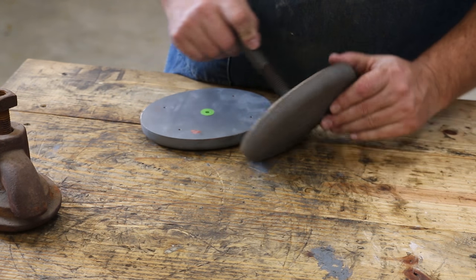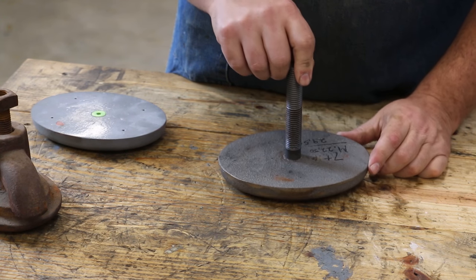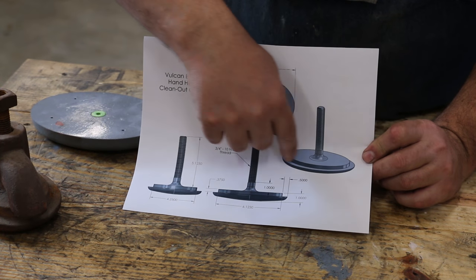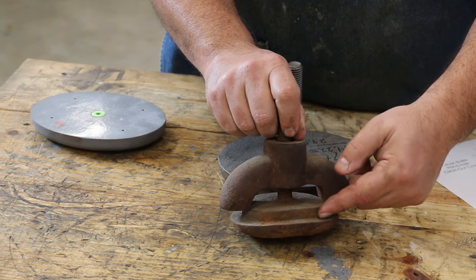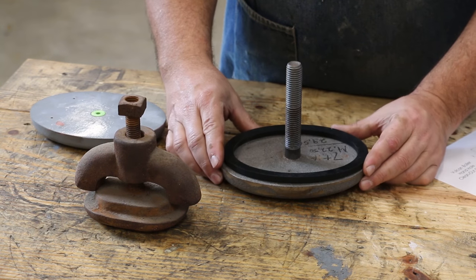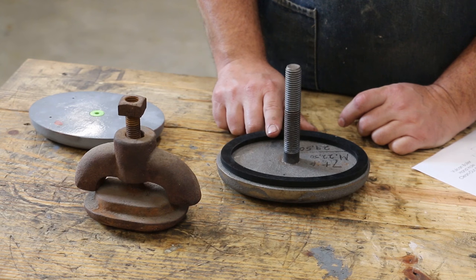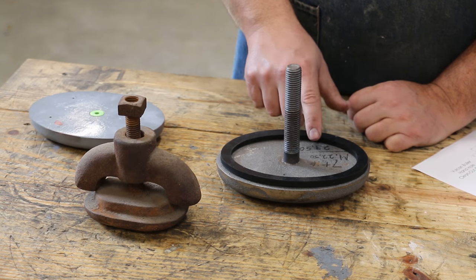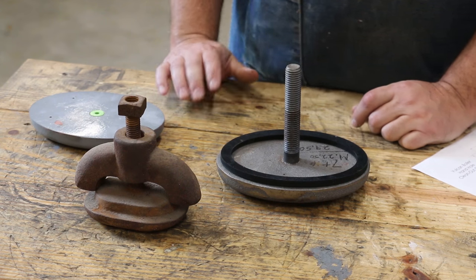So this is where we're at now — we have the actual casting, but it's not complete. There's one more step: we need to have a little lip milled down in here, kind of like this one. You want it to register up into that oval hole in the boiler. There's also a rubber gasket that will go in here, so we need to mill out a little notch that the gasket sits down inside of. The casting will come up a little bit above the top of the gasket, and with the machined recess it will perfectly align the gasket into the hole.